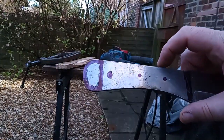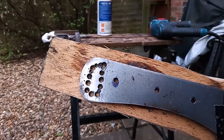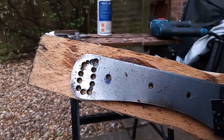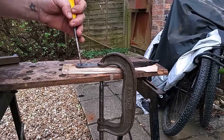Three holes for the pins and I'm going to chain drill this, so it should end up looking something like that. It would be better if those holes were a bit closer together, but they're not, so now we're just going to try and break through and have a finished oval.